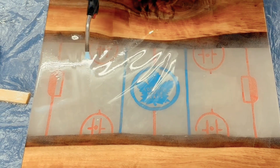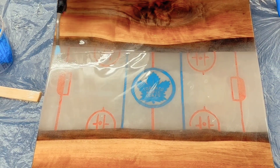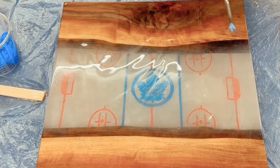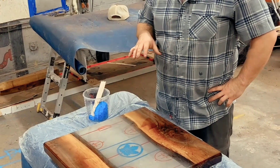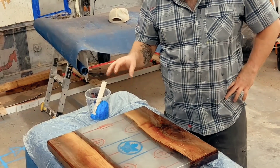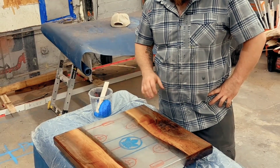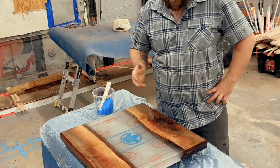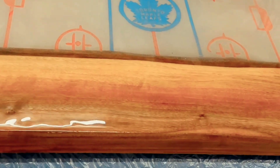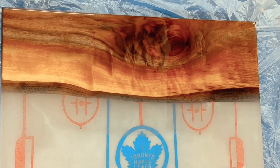Make sure you don't leave the torch on any spot too long, but I like to go at a slower pace to really help pop the bubbles and flatten this table up. We just finished our first flood coat. This walnut is going to be sucking up a ton of epoxy, so you'll get some bubbles — you can pre-seal the wood with epoxy, but I just don't find I need to with this setup. Over the next 20 minutes I'll keep an eye on it and pop all the bubbles. After about 40 minutes you can still see all of the reaction areas, but it is what it is.